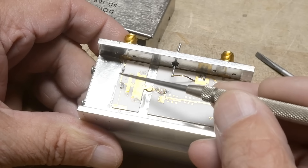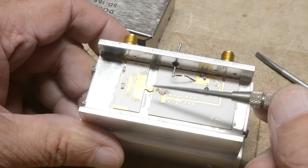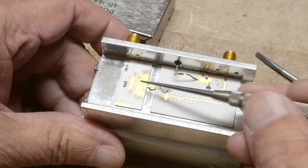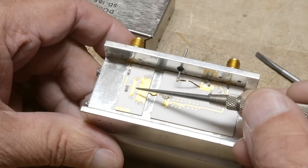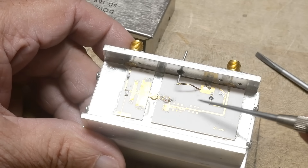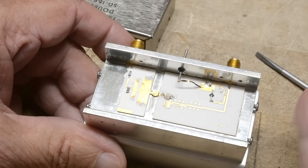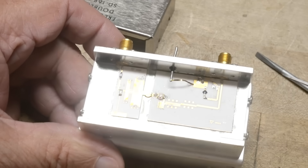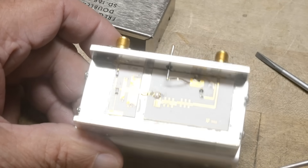So it comes through this capacitor and into here. There looks to be a resistor loaded to a capacitor, just some kind of matching. Then it comes through these two stubs — again, matching. There's a bunch of little squares you can short out, and it's got silver epoxy to put the ceramic plates down with, because there's a ground contact on the bottom. That conductive goo is also used to do the matching — they just dab it on until their VNA makes it look good.